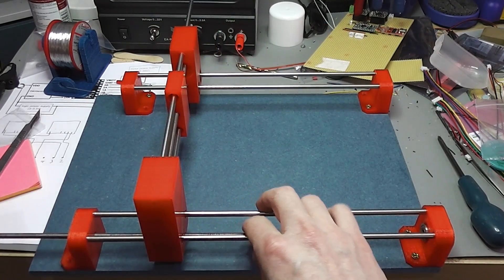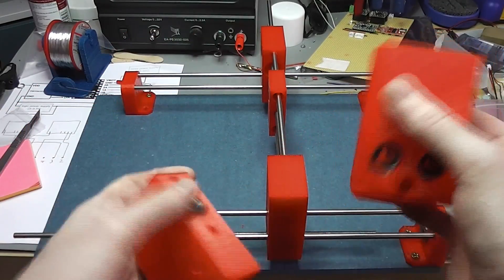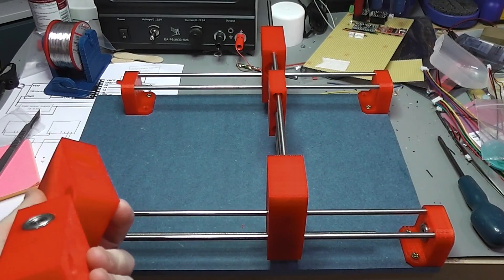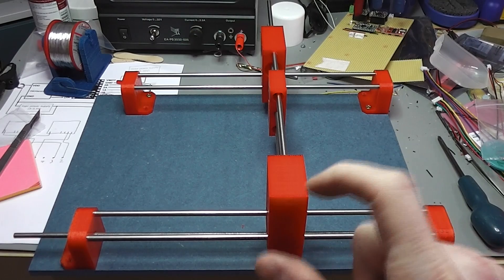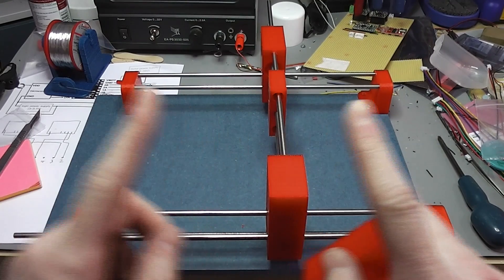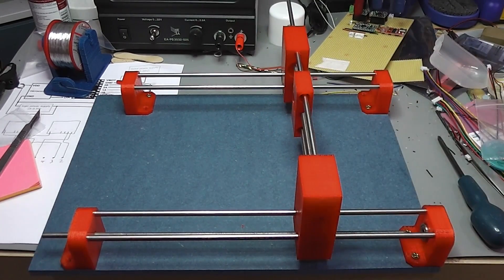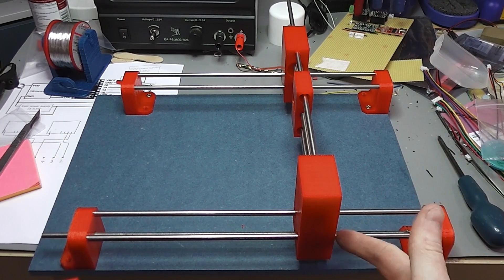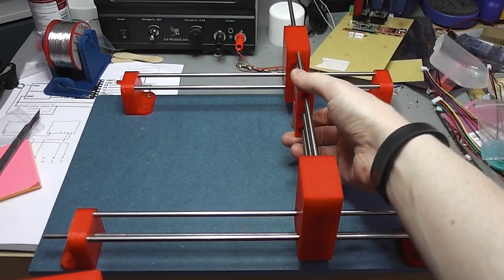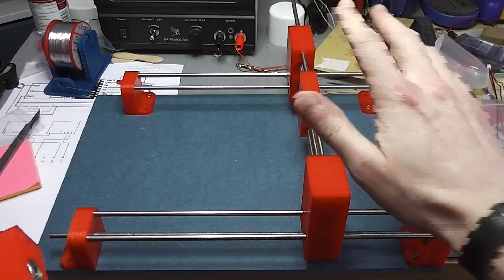These parts here have undergone a number of changes - I've got three or four other prototypes. These are the larger 6mm or 8mm linear bearings in this first one. I finally got the correct ones through: really tiny, 5mm shaft, 10mm outer diameter, 15mm length. They fit within this piece here. At the moment I've got two in this one. This is still running the original larger bearing so it wobbles a bit, while the others are quite smooth. There's a little bit of movement, so I'll probably need to stack two linear bearings next to each other to stabilise it.